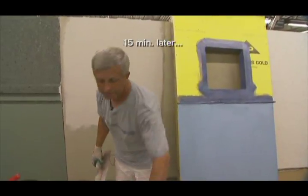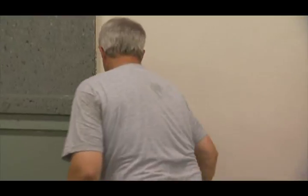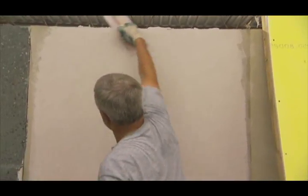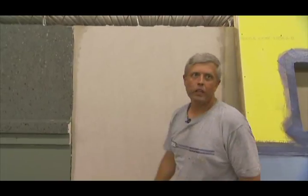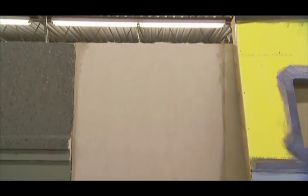Notice after I take a trowel and slide across that surface — again, one direction. You can touch it now; it won't hurt, it won't stain your fingers. You can actually feel how smooth it is. All you're actually doing at that point is going one direction and walking away from it — never touch it. It'll have a mottled appearance as it dries, but when you walk up to it right now you'll feel it's just very slick. You can actually hit it another time after, letting it go for an hour or two if you want. You can feel how smooth it is right now.